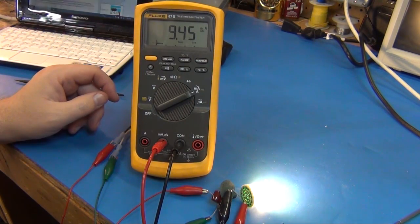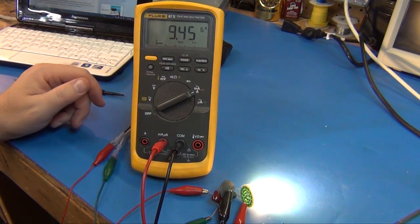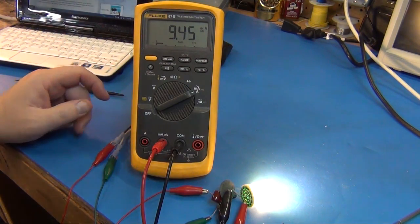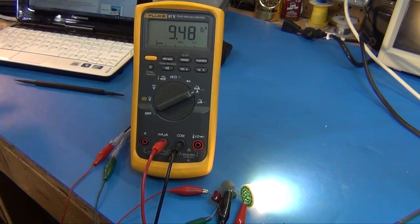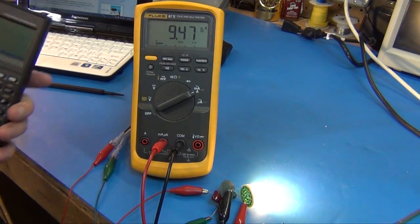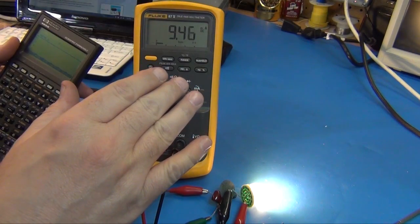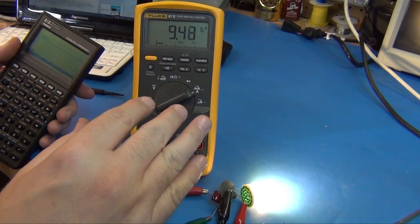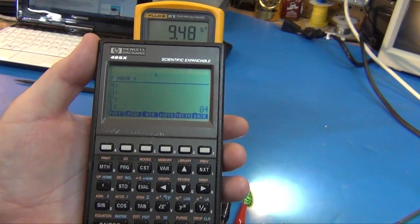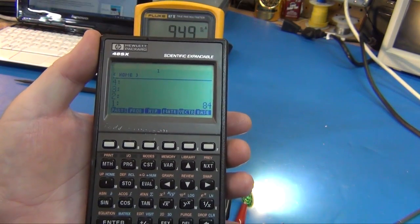About 9 milliamps DC. I suppose that's to be expected because it's mostly a DC signal. It's with a big ripple. So let's assume that that's a straight-on DC voltage. Just don't worry about the ripple, though there's a pretty amazing ripple on there, a 25 volt ripple. And we're running about 9.5 milliamps.